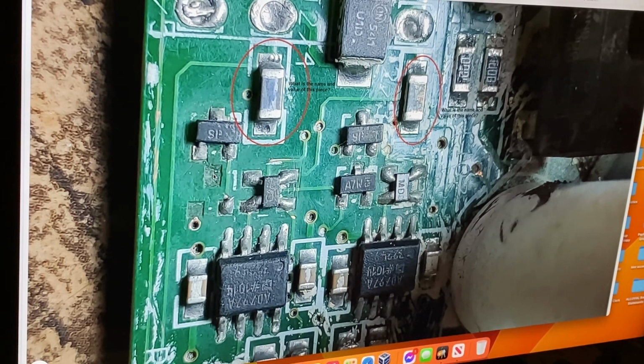This one here is normally, I was trying to remember, I haven't looked at these for such a long time, but I think this has an eyelet under the board. That's it. That's the BSS84. That's a P channel MOSFET that connects directly to the non-inverting input on the AD797.